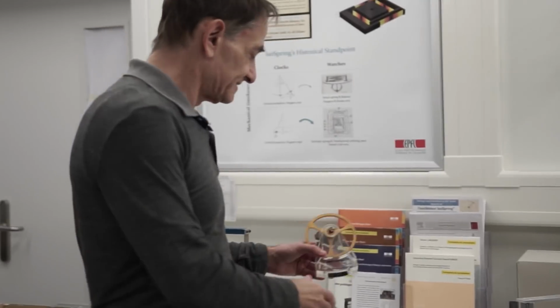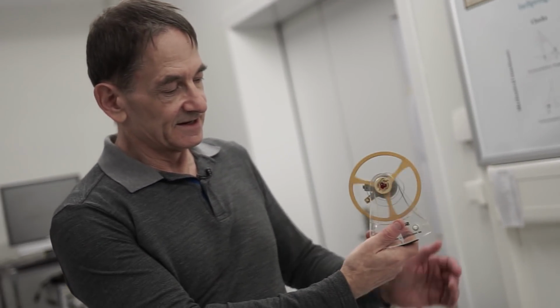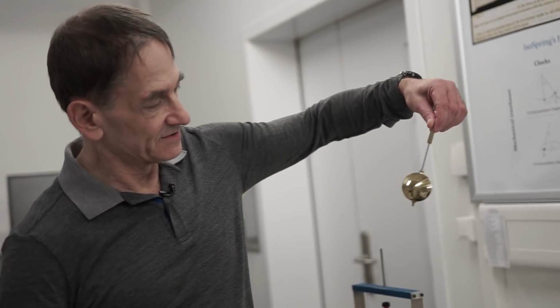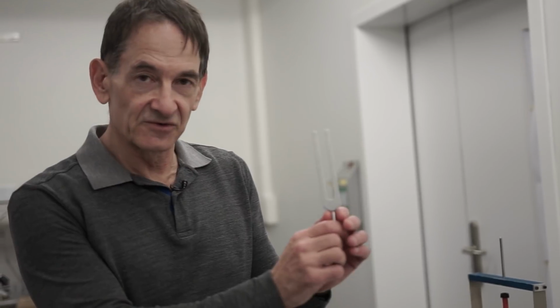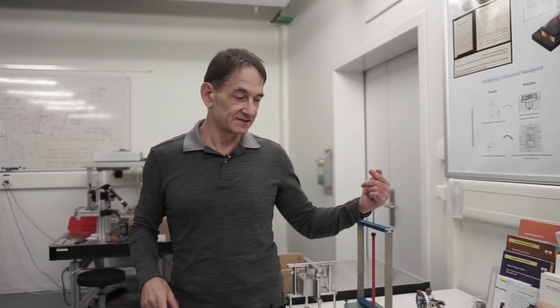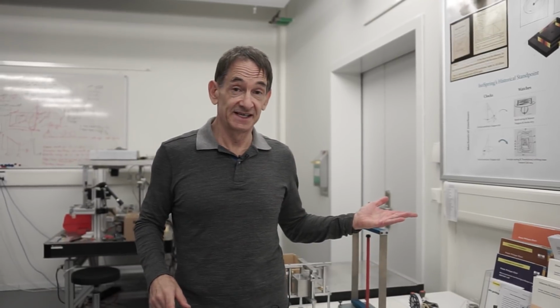If you look at the classical time bases, there's, for example, the balance wheel. You see that it's going back and forth. The other time base for a clock is the pendulum, which also goes back and forth. Every electronic watch, quartz watch, has a little quartz tuning fork. And also, there's 2 blades, and they also go back and forth. The reason is that the movement is 1 degree of freedom. Here it can only move at an angle. If you're trying to oscillate in 1 degree of freedom, you've got to go one way, stop, and then go back the other way. And to keep it going, you've got to give it intermittent impulses. So you've got to have an intermittent escapement. This is the way it is.